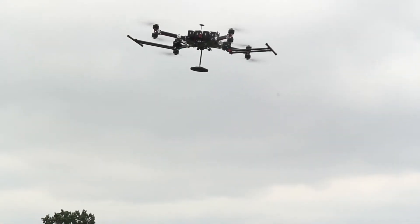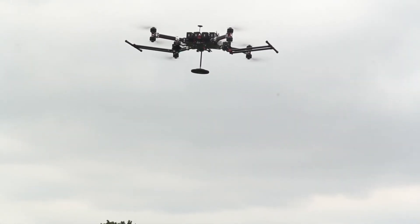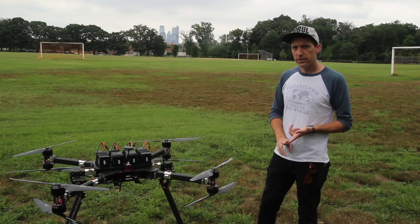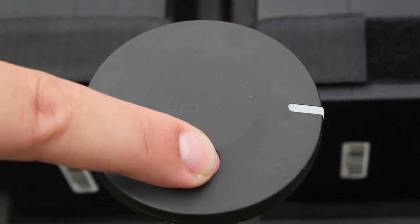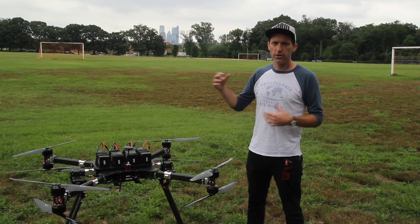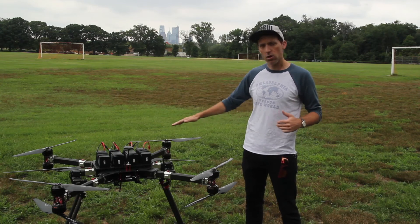Another really great feature is there's a lot more flight mode options. Depending on your mission type, there's a much wider variety of flight modes. There's also an added safety feature — to arm the motors, you have a little button here on the GPS that will disarm and arm the motors. So if you're working on your UAS and you don't want to worry about the motors turning on, you have the ability to kill all the motors from that button.